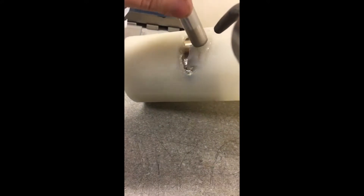HDPE doesn't really liquefy — it likes to be extruded, pushed. Heat it up and then push it into the material. We're going to push it together with this plastic rod and see what happens. And that is the best-looking joint I've made with this mystery material. Out of anything I've tried to fill holes with, the closest I've found so far is this milk jug. We got to witness the very first successful joining of this stuff.